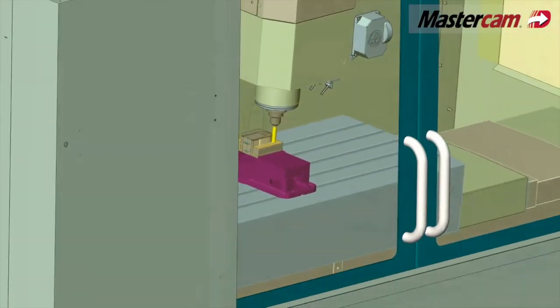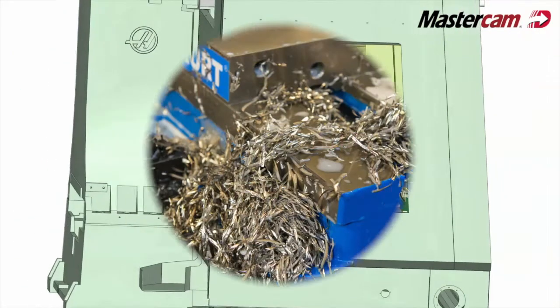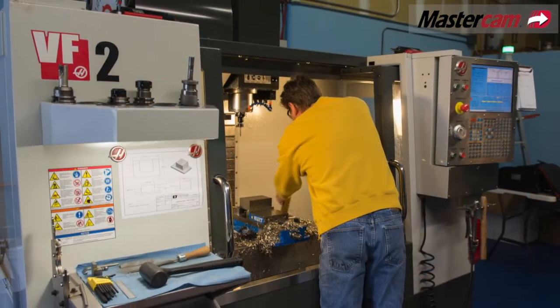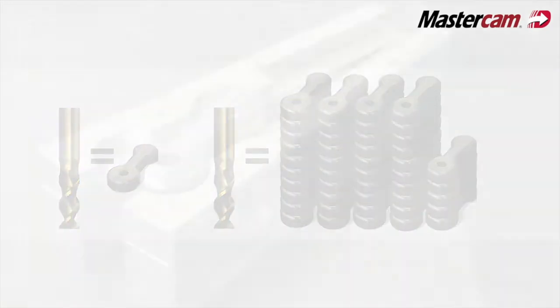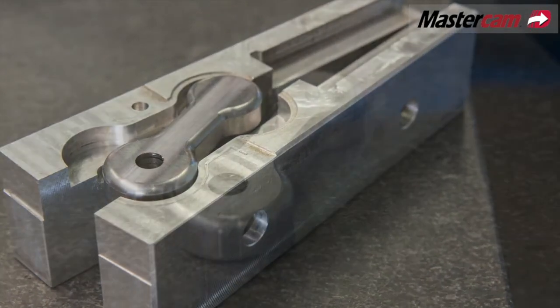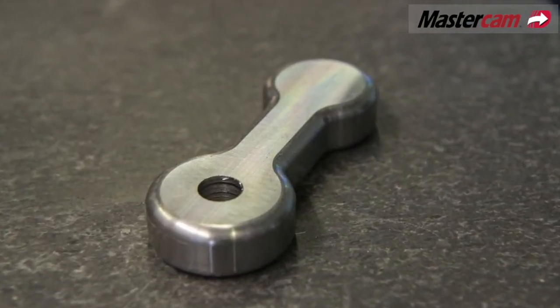It's like you've got a race car — let's see how fast it can go. After probably two runs making these parts, the cycle time went from one hour down to five minutes, and the tool life went up to approximately 45 parts for one tool, and the tool was still in almost new condition when I was finished. Mastercam — that's the way you want to go.